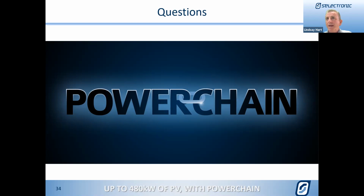Thank you, Ivan. An anonymous attendee is asking what happens if a worker SP Pro fails in a system. Well, we did cover that before. Do you want to just give a quick summary on that again, Ivan? So, quick one on that. If a worker drops offline, the system continues operating as normal, but obviously with reduced capacity. The system manager knows that that's gone from the system, so it automatically reduces the system down to work without that worker in place. Thank you, Ivan.